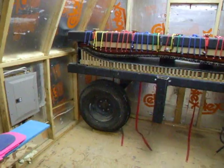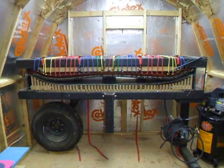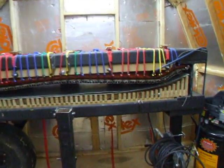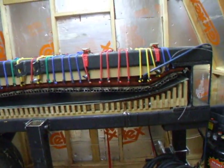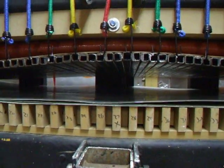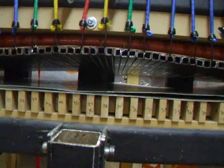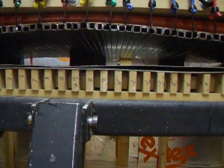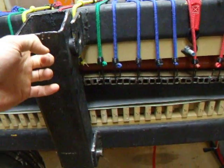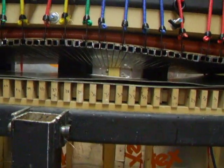There's a wheel at the bottom because all this metal was scrapped from an industrial potato planter made by yours truly. So I made this whole press, down to the pneumatics and electrical. As far as the frame is concerned, it's about 84 inches long from I-beam to I-beam. In the back we have 3 vertical pieces of channel for support up and down due to the bladder. Once you insert said ski into the press, this also goes up to provide some geometry stability in the front.